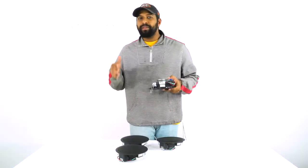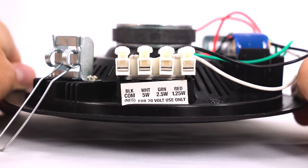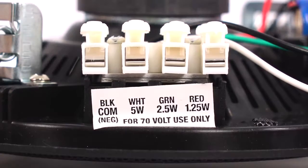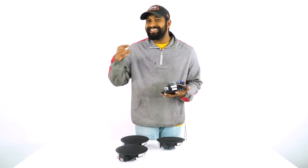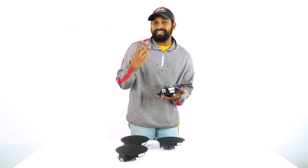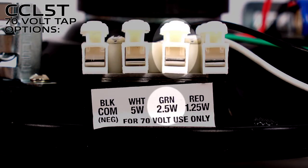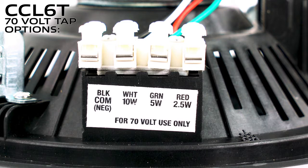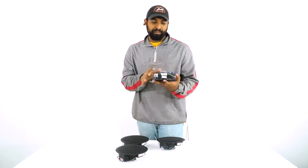We made a video in the past explaining 70 volt technology and all its benefits, but in a nutshell a 70 volt tap is a transformer built into the speaker that's going to pull a fixed amount of watts from the amplifier to this speaker. In less technical terms, that just means you have options for how many watts are going from the amplifier to each speaker. In this series, both the five inch and six inch speakers can be tapped at three different options. For the five inch speakers you can tap them at 1.25 watts, 2.5 watts, and 5 watts. For the six inch speakers you can tap them at 2.5 watts, 5 watts, and 10 watts.